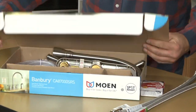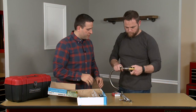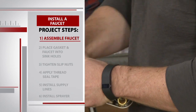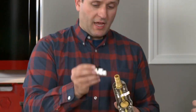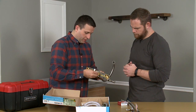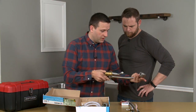The first step is assembling the faucet. Go ahead and just tighten that top spout onto the base of the faucet. This part is all about following the directions that come with your particular model. We are going to be using the sprayer, so we have to add this little diverter on the bottom of the faucet here. This actually just snaps into place. So the faucet's all set.